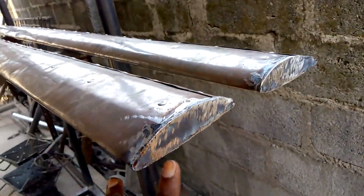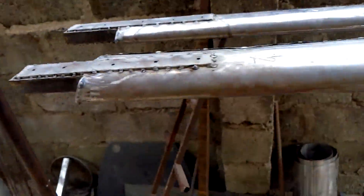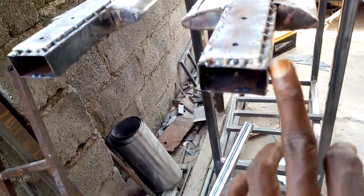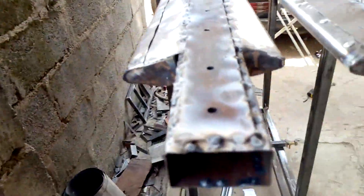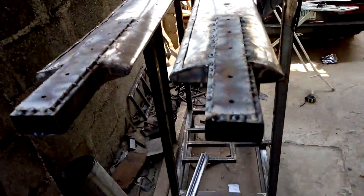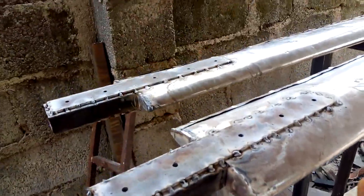I just want to do this video to keep you guys posted on how I did mine. The skeleton I used inside is about a 2-inch by 1-inch, 1.2mm thick square pipe. That is the skeleton, and everything is perfect just as you're looking at it right now. I did nice riveting and used 0.5mm sheets for the covering, and everything was perfect.